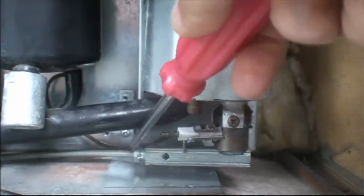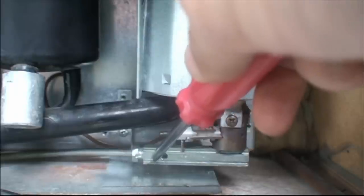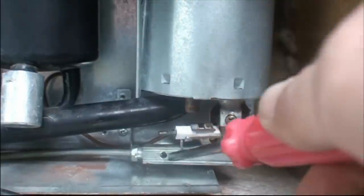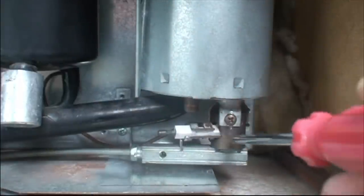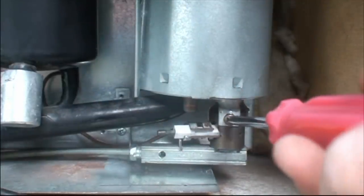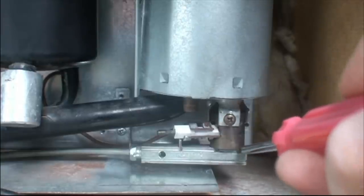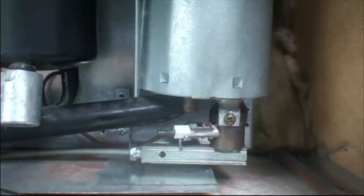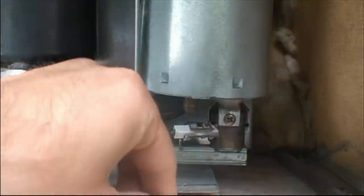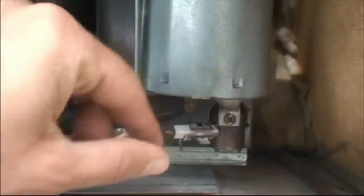Okay, so I reconnected this with the aperture cup on the end right there. So that's just been put in, and I just slid it into there. Just put that on with the standard Phillips screw back on and the washer. That's on. You gotta make sure this is level as well. If it's not burning level, you're not gonna get as hot as you want to be. And it's all about getting hot out here so that it gets cold in the fridge.